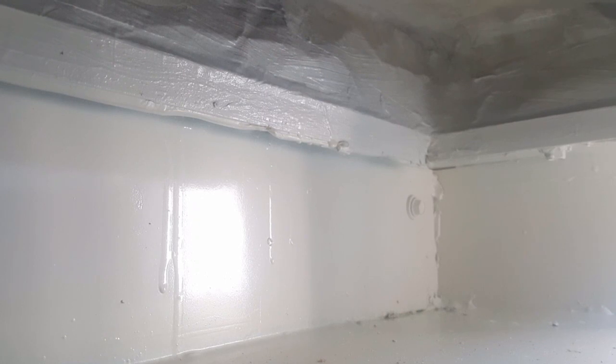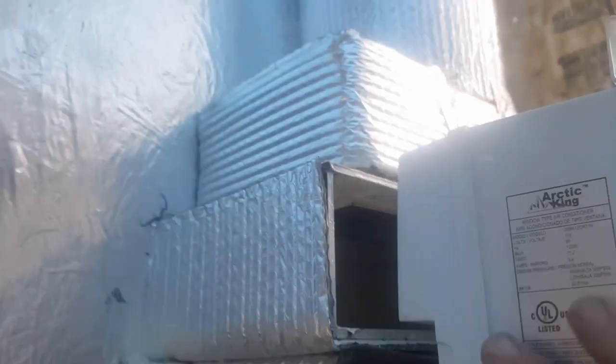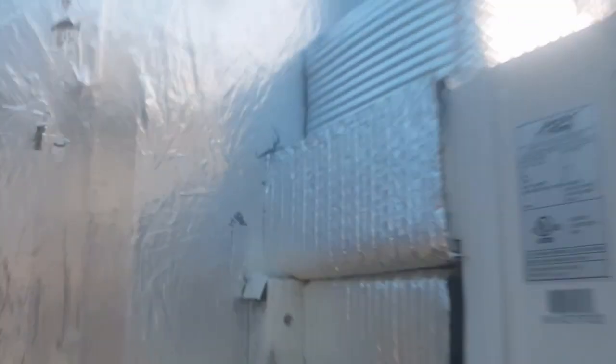Here's our return air gasket on the outside that came with the AC, and then butyl tape and foil tape at the wall penetrations — we do that everywhere. Underneath there are a couple of self-tapping aluminum screws that hold this to the wall. You need to use aluminum or stainless because you get moisture inside your AC system and you don't want anything to rust. The cold air goes up and through. You spray on some 3M heavy-duty adhesive and stick your R-foil to everything — it makes a nice thermal barrier. Then slide this baby in, super easy operation.